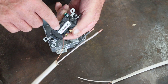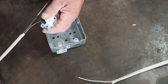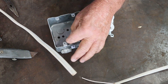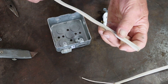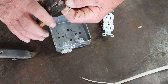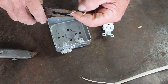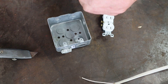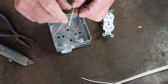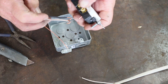To release a wire from those back-stab slots, there's a little slot you push in and the wire comes out. Now, you're not going to have the luxury of working with the wire out in the open — it's actually going to be coming through the box. So what you'll want to do is clip your wires, strip the insulation off, and then make your little hook — just like so. Strip off just enough to make a good hook to go around the screw.